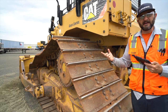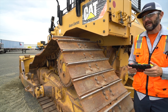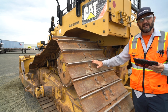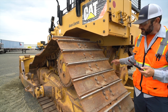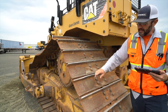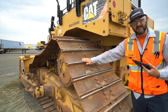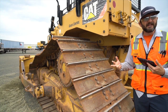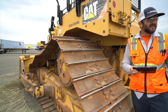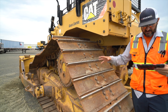For those of you following along at home, we'll move through this quickly so if you're out in the field inspecting one of these, this video should rapid-fire through. The first thing is steel track undercarriage — shoe width is measured across here. Grouser bar type: these are the grouser bars that give the dozer traction. There's one per shoe on this machine, so it's a single grouser bar. Triples you usually run into on excavators, and dual grouser bars you'll find on track loaders like a 963.